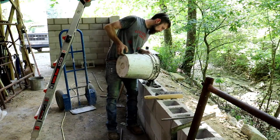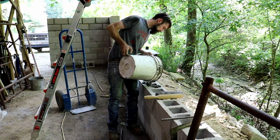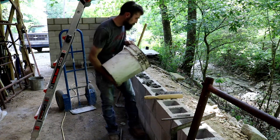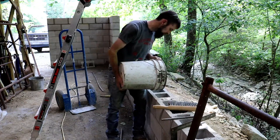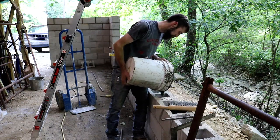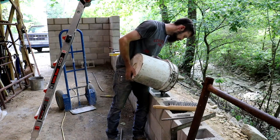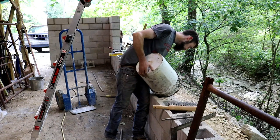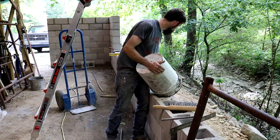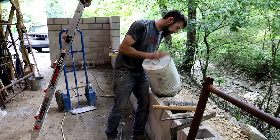So here's a job that was a ton of work, and that's grouting this lower wall solid. Now this needs grouted solid simply because I'm going to be drilling into it to put the pins in it, or the rebar in it, to help support my floor. You wouldn't have to grout every cell, but that's what I'm doing. And it's a little more work than I thought it would be. But bless you. I'm almost done. Probably a good day's worth of work left.